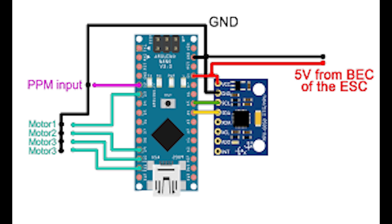But what really makes quadcopters possible to fly is having an IMU, a gyro, and an accelerometer that can sense the motion and the absolute angle of the drone to help that drone be able to fly. Right, you gotta tell the flight controller what the drone's doing so it can know how to compensate. And this is, I think, the most interesting part of these early pioneers who are making their own flight controllers: where the gyro came from.